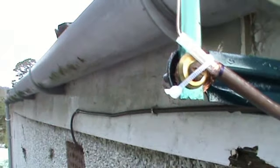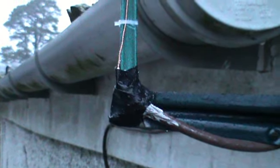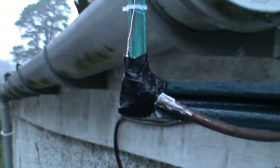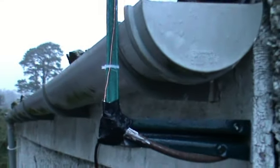That's it finished on the outside. What I've done here is: this is the support piece of plastic with the copper wire running 250mm up there. The inner braided wire from within the coax cable is wound round the nut and bolt which fixes it to the bracket. I've anchored it down with cable ties and put a couple of cable ties onto the plastic support piece to hold it as well. From there it just goes along the wall and into an air brick out of the garage. To finish it off I've put some silicone round the ends of the cables and also lined it with insulating tape, just to keep some of the weather out and make it look a bit more tidy.